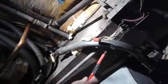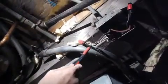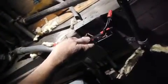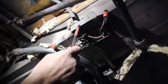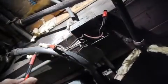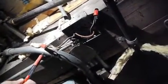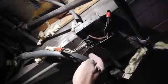Now, if we can switch over to here for a second, this is what a handyman does. And this is another electrical deficiency that you should look for in your home. We usually find open electrical boxes like this above ceiling tiles, in garages, or in attic spaces where the last person present doing the electrical work assumes that no one else is going to see it. These wires are supposed to be placed inside the box, and the box is to have a cover on that.